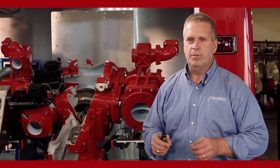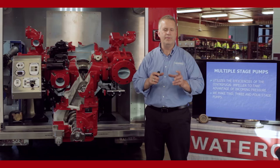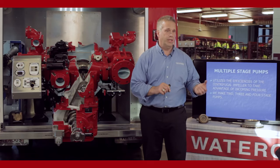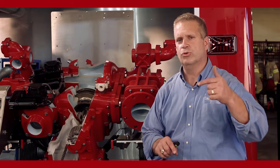The New York City high rise pumper is a perfect example of a three stage pump. They use our CMU pump — two stage with an extended impeller shaft — utilizing a 750 GPM pump. They can actually produce 500 gallons a minute at 700 psi for charging standpipes. We also make a four stage pump, the CP4, rated at 90 gallons a minute at 1350 psi. Each impeller adds pressure as the water passes through to produce the 1350 psi.